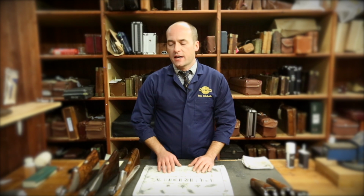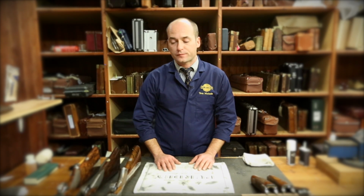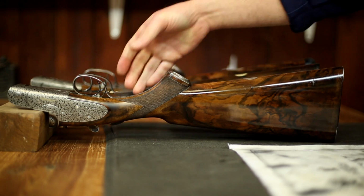For obvious reasons, dirt, water especially, is not good for the life of a shotgun or the mechanical function of a shotgun. So again, at the end of a shoot, it's always good to clean any exposed areas. And in the case of the sporter, which has a removable trigger plate, remove that trigger plate and give it a clean and re-oil and grease. So, I'm going to cover off the best gun over and under first.